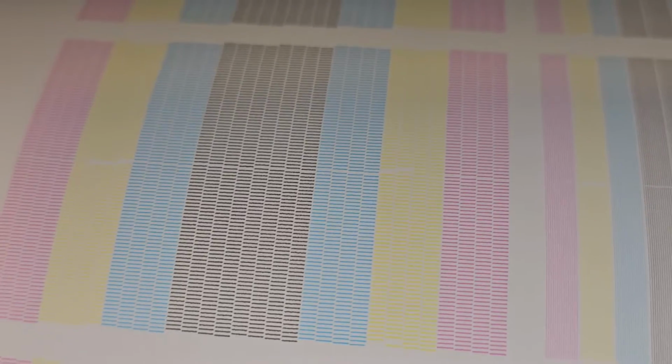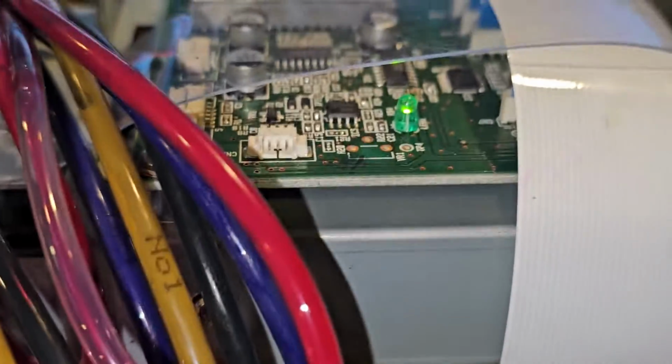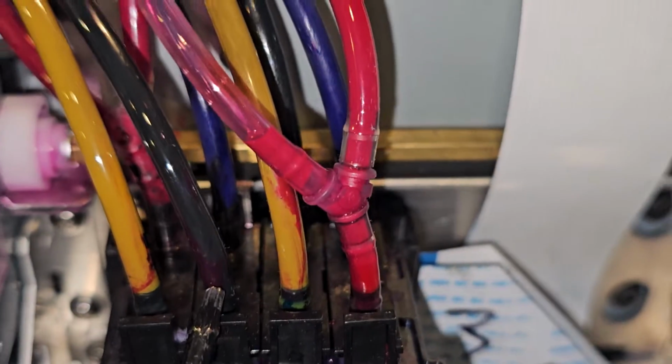But when you look at your print head and you see your colors, they can be confusing because sometimes they're in the wrong position. So in this case right here, we're missing this left side black, the left side. So most people would think this black line right here, on the left side of the print head, is the problem. So they start troubleshooting this line, but in fact, this one is actually in the back right there. It's that black right there that's causing the problem.